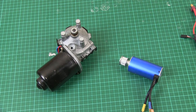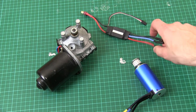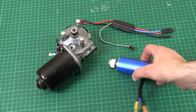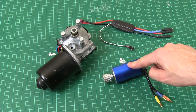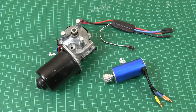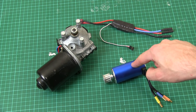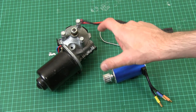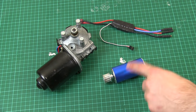I've done quite a bit of investigation into brushless motors, and I've got one here — you'll notice it's got three leads, and you need one of these special drivers; this is a really cheap one that costs about £10. This motor is an in-runner, and what Oliver had was an out-runner. Out-runners go slower and have more torque, turning propellers directly, but motors run more efficiently when going quickly. So for robotics, you want the motor running fast with a good gear train — which is why in-runners, like this, are actually preferred for robotic applications.